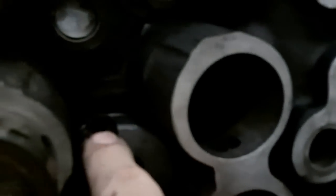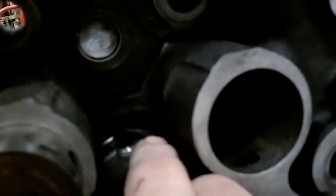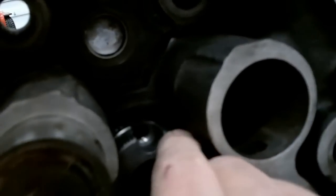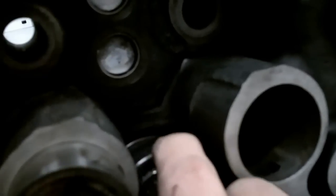You've got to put it in, and once you get it tightened up, this is the glow plug hole right here. You've got to have your glow plug within 15 degrees of your center line of your crankshaft, so you have to use different gaskets of different thicknesses to get it to do that.